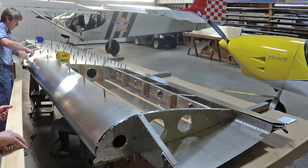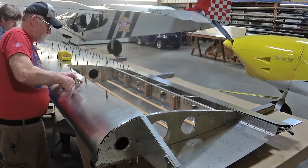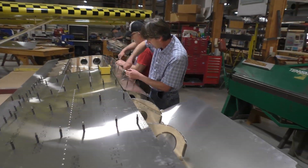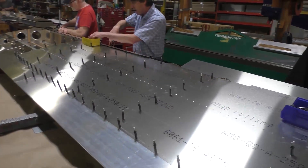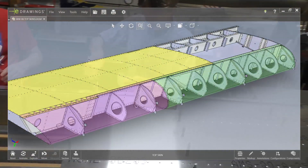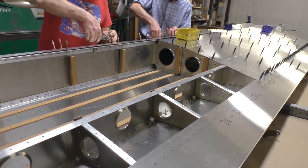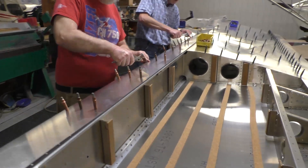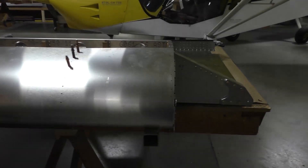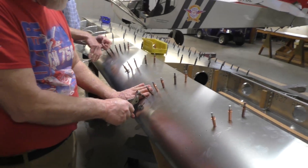At this point there is no drilling involved. Sometimes you've got to go hole by hole, otherwise the grid is just flexing a little. So all these holes here are final hole size. Correct. That's the nice thing about the match hole — if it doesn't fit, you probably need to back up and see where the issue is. Once you get about halfway down the rib, you want to start going every hole just to make sure you get good form around the nose of the rib.